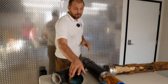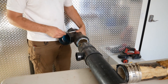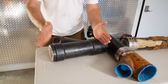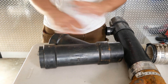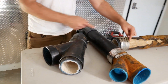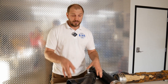When you have a system with a three-inch branch, two-inch branch for the kitchen connection, another three-inch line, and a main line, pull-in-place is called a free spot. What does free spot mean? It means the liner goes through your main line up to each branch junction — but this section of the fitting combo, the Y or whatever it is, is not lined. It's completely open and free of epoxy. This is a problem because if those fittings have cracks, roots will grow in and break the pipe from inside.